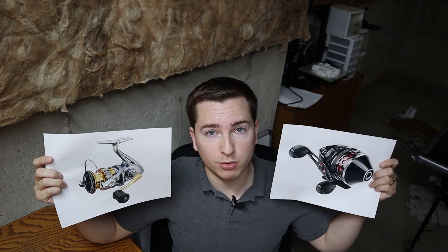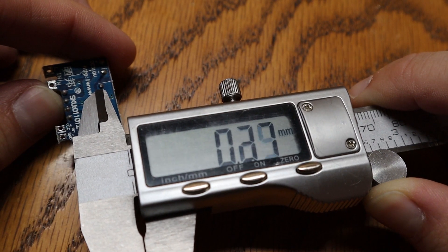These are actually the same kind of devices used in USB wall warts, but there's one key difference — let's talk about safety. Do not use this switching regulator in any application where the user is not insulated by plastic housing. These are cheaply made things that will shock you. Trust me, I'm an engineer with a year of experience. Anyway, let's use this in an application where I'm not insulated by plastic housing. To make sure this power is on, we'll need access to 120 volts — the easiest way to do that is to find an old electrical cord.